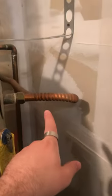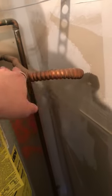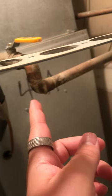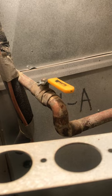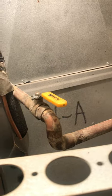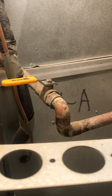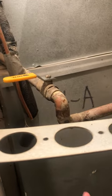Find the first one here on the top — this is one of the main ones we're going to focus on. Right now this will be kind of hot because the heat is coming from the water heater and going to the furnace coil. Locate this pipe and follow it around to where it goes. You can see right now there's a yellow tab on it, and that tab is following the pipe completely in the exact same direction. So what we want to do is switch this to the off position. Basically what that does is cut off the valve from allowing the heat of the line to get to the coil. So that's the first one — done.